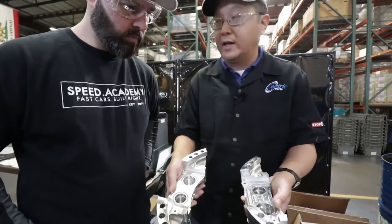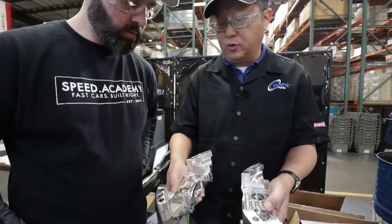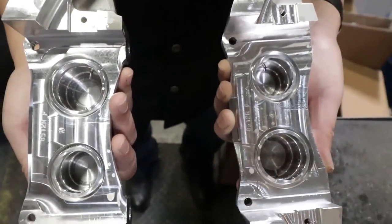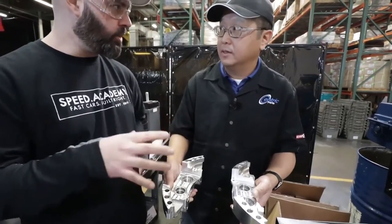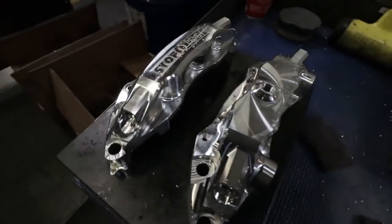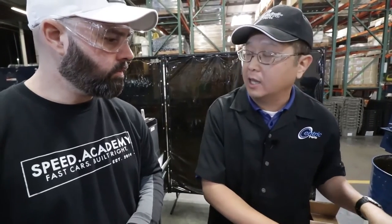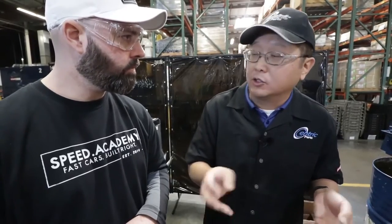They've been cut to the correct diameter. There's a groove in there that holds the piston seal, and an upper register groove is where the dust seal will be pressed in to protect the bore, the piston, and the piston seal from contamination. So you're engineering your bore sizes specifically for each application so you don't need a proportioning valve — you install it and you know you've got the right brake balance. After machining is complete, we go into outside processing — how we apply our finishes on the caliper. That'll be anodizing and paint, done off-site, followed by a quality check for visual surfaces to make sure there are no damage, paint flaws like fish eye, dirt, or staining on anodized calipers.